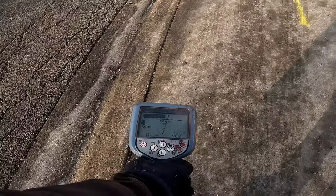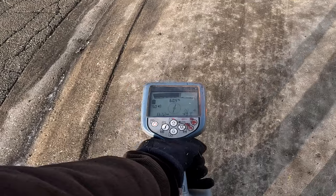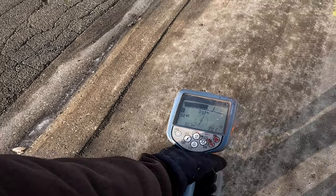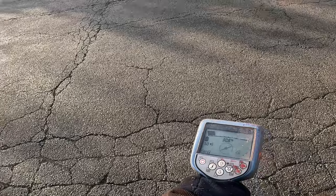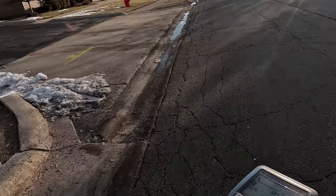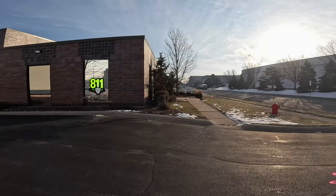Okay, now I'm at the same spot on 50, and I got a tone here at 3 feet. And it's 76 milliamps. So that's not guaranteed this is the cable yet. Let's complete the sweep. Do another 360 to make sure that's the only tone we got with those milliamps. All right, folks, that's the only tone.